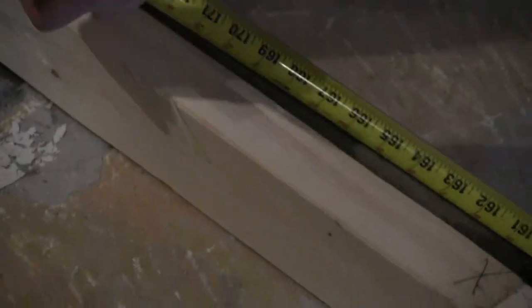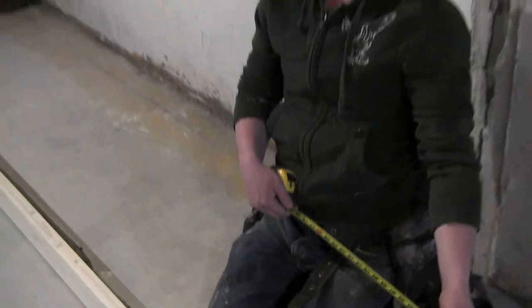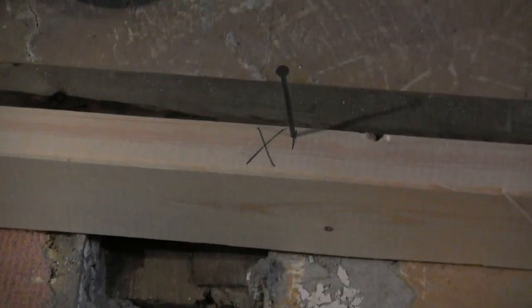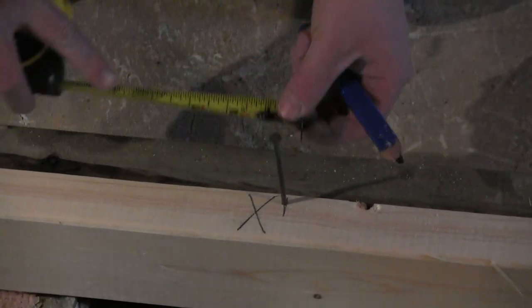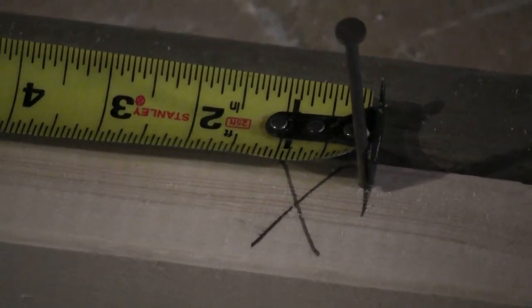And then I'm going to mark one more. Let's say I ran out of tape measure and I have to start pulling again. I put a nail in there — I put a nail on the right, on this side of my mark, so that I'm basically pulling from the actual mark. Now this tape, I like to just tuck it around the nail a bit.